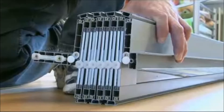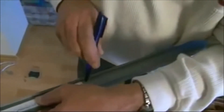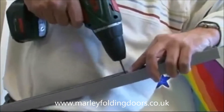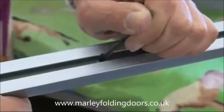For the next step, the door stop must be assembled. Fold the door completely open in order to accomplish this. Measure the width and transfer this to the upper guide rail. A clip serves as a drill template. Pre-drill a 4mm hole, then remove the clip and enlarge the hole using a 6mm drill bit.